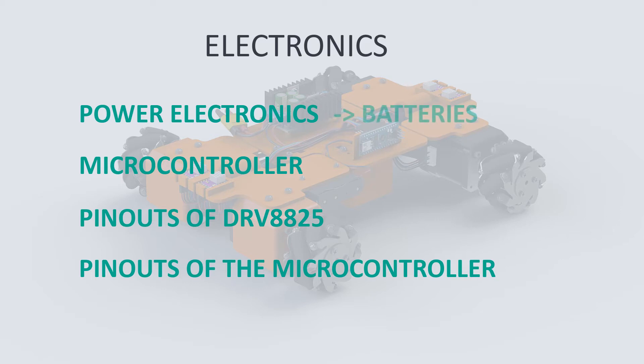In the third step we will choose the batteries needed to power the M2R2. We will talk about the current and the voltage that we are getting from the batteries. As a last step we will choose a DC to DC converter to stabilize the motors' voltage input. Even though the drivers can accept an input from 8 to 45 volts, here we will use a stable 12 volts to have more predictable movement control. Let's start now with the motor drivers.